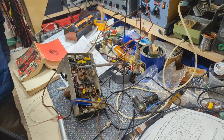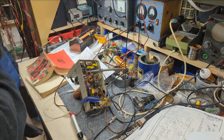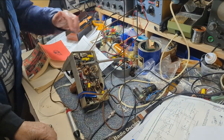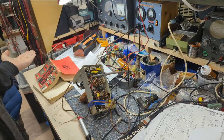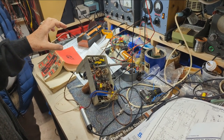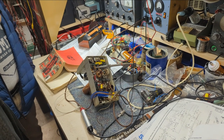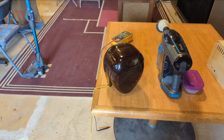Oh, okay. What is it? Is there like a battery? Where's the battery? They're right here. Like little button cells. Yeah, we need a 1-volt battery. Do you have a dead one of these? Is it 1 volt? See, it's 1.5. Good luck. And if you put a resistor across it to drop it or a divider, you're going to burn the batteries down. You can't have any current because these are bias batteries. Okay, we figured out what it was.